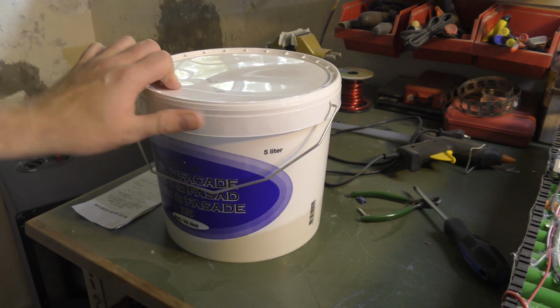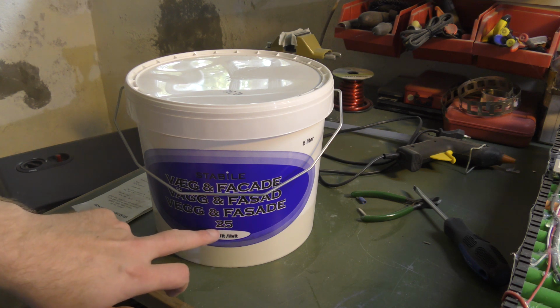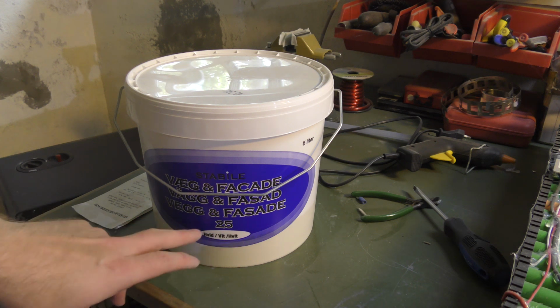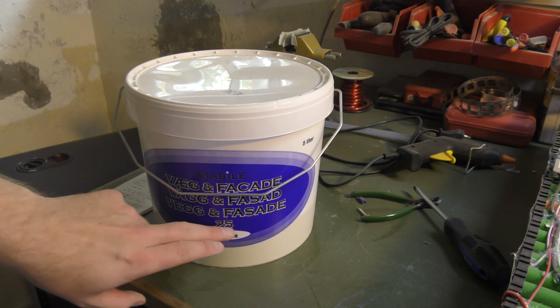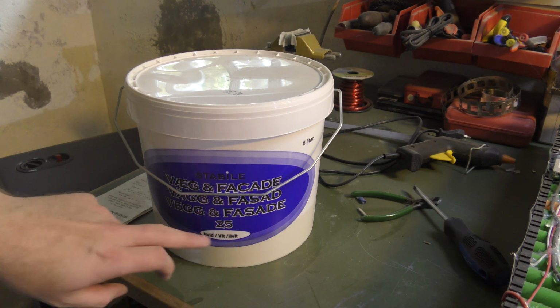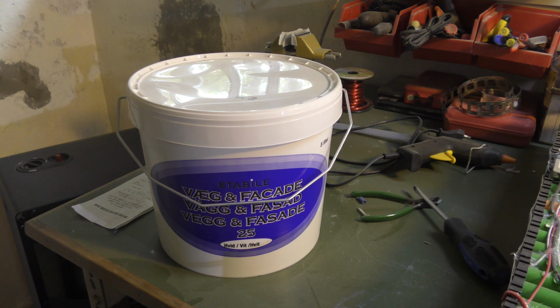I went with a paint that has a 25 gloss. That's, you know, if you're painting the ceiling, you can go with something very low, because the ceiling is not gonna get dirty. You're not gonna need to wash that off. If you need to wash something off, the higher the gloss here, the better. And I went with white. So I need to go get a stick to stir that up, and we can start applying that. I do believe that I want to put something on the floor as well, and then I need a roller.